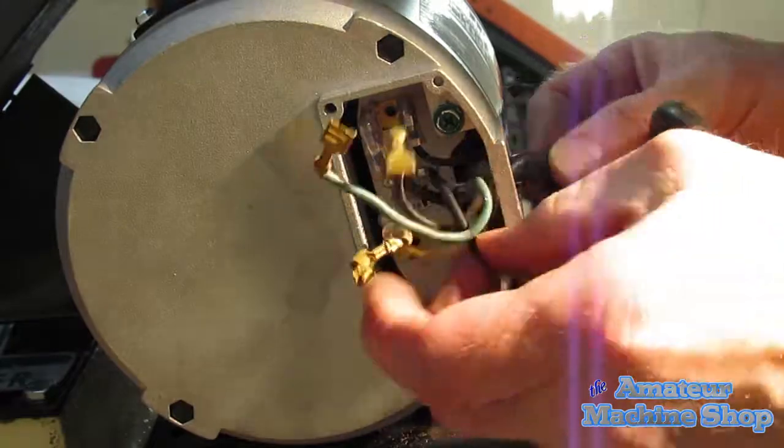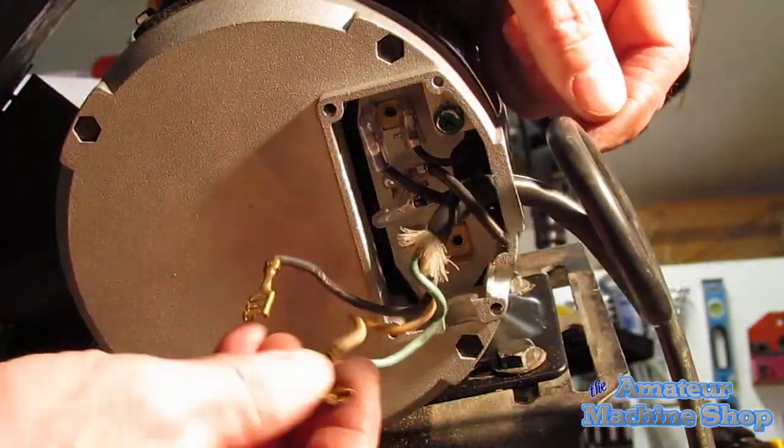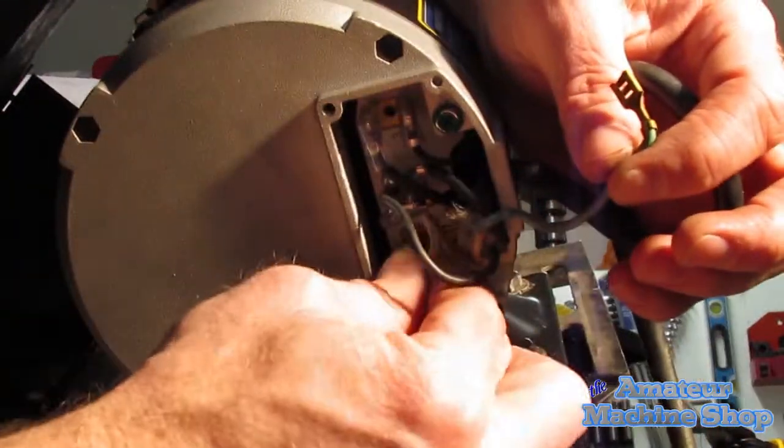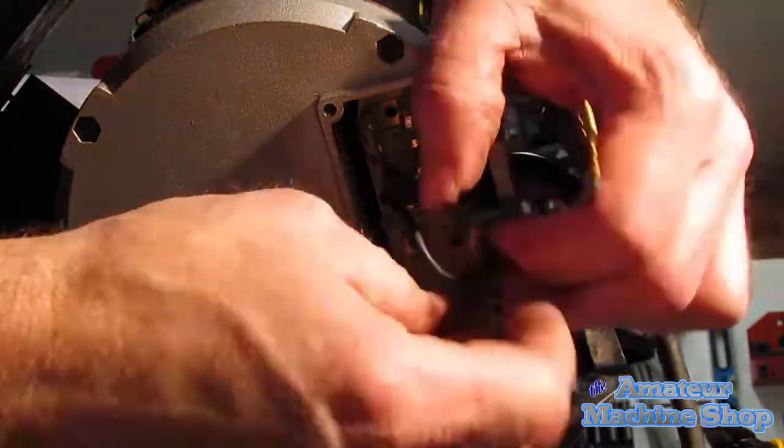Again, since the wiring already has disconnects crimped, all I had to do was plug in the female connectors to the corresponding male terminals. For the ground wire, I decided to strip the wire and screw it in place. I didn't have fork connectors, and the screw will easily hold the wire in place.